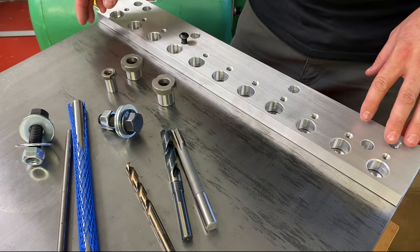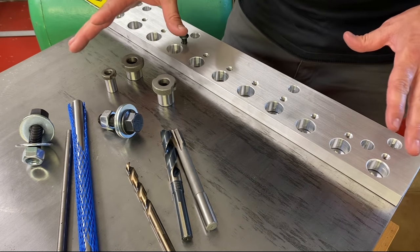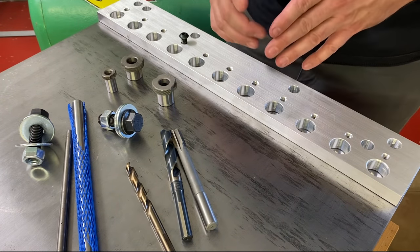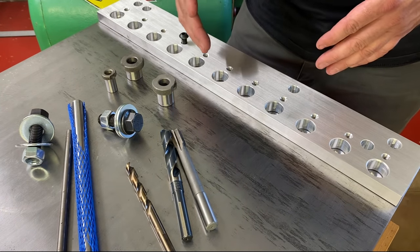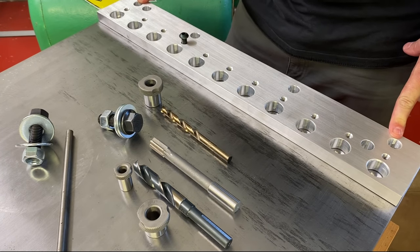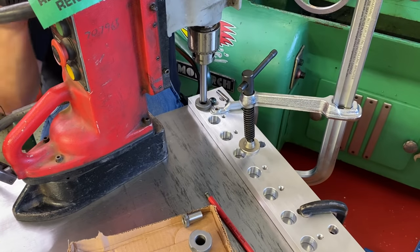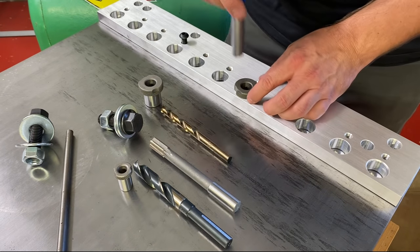For the drilling, what I've got planned is going to be quite a bit of work. I just didn't want to go straight to a 5/8 drill, because we're going to do 5/8 holes, and I wanted the best diameter 5/8 hole, as close to dead nuts as possible. Go ahead and make the alignment pins for these two holes. I'm also going to take a short piece of this and use it as an alignment pin to put in the drill chuck in the mag drill, centered over the hole. Then I can turn the mag drill on, pull all this out, and begin drilling.